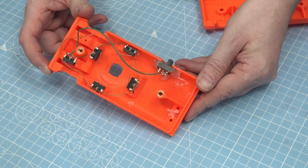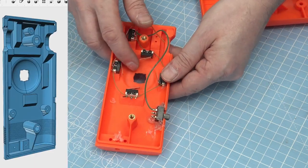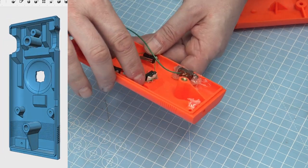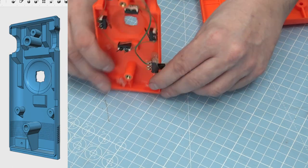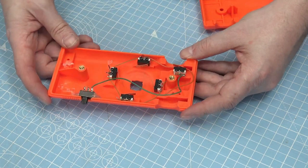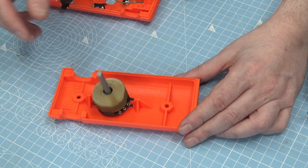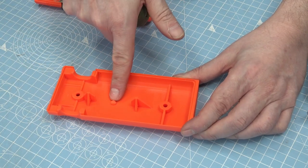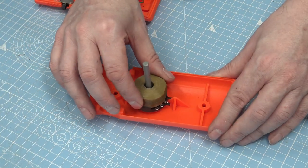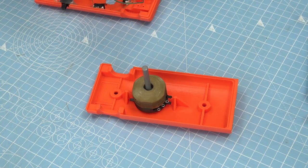So this is my bottom, and this is the original. There are lots of features that are the same, but I tweaked things to make 3D printing easier. For example, this ramp just here — because it's printed standing up — means I don't need any support on that part. Here we have a quick ASMR of removing the supports for this orange case. In my first version I just screwed micro switches directly into the case. I've got these angles so that when it prints standing up I don't need as many supports, because supports are wasted material and just take time.